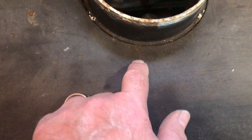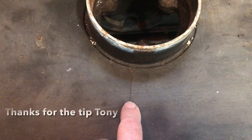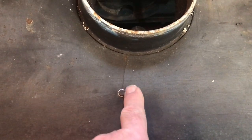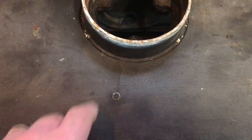I've drilled that out at the end so that the crack doesn't follow on, and then I put a little bolt in there. But what I'm going to do is grind that out and I've got some extreme JB Weld that I'm going to put in there.